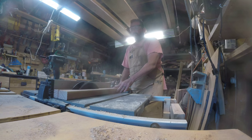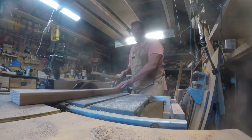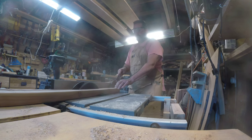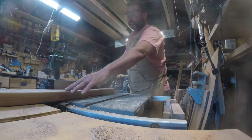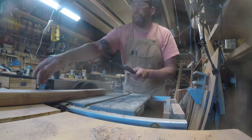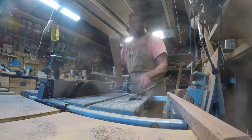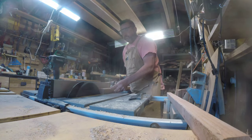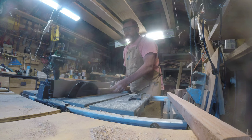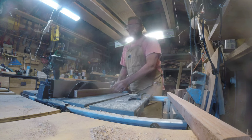I don't know if I'm going to since I have other jobs in the works. We're going to build two planters and one bench for this phase. The planters are something I don't do a lot. The first one's going to be a little bigger — the bottom shelf is going to be about 16 inches wide at the bottom, tapering to about 9 to 10 inches at the top, with about a 10 degree angle. The first one is going to be about 34 inches high.